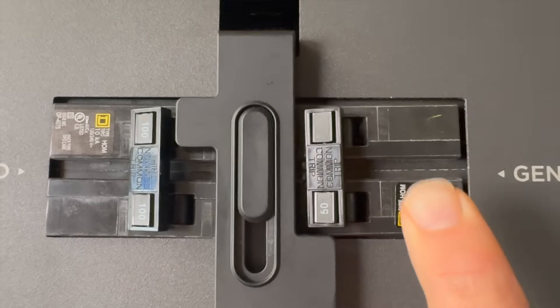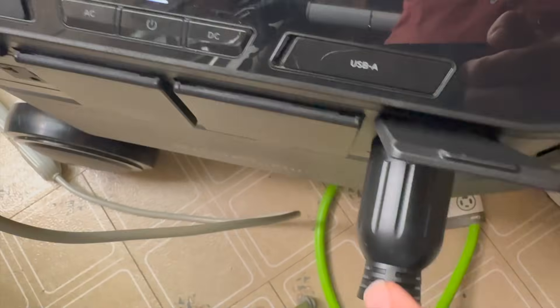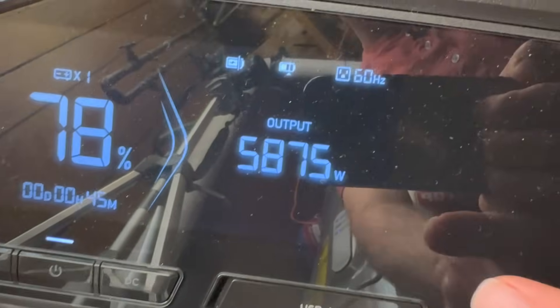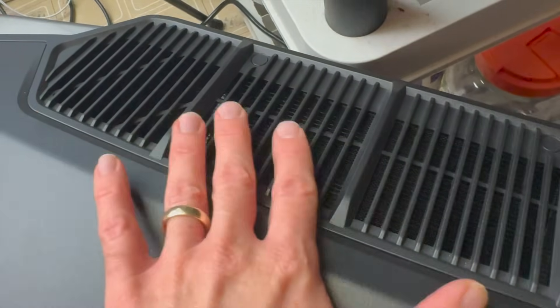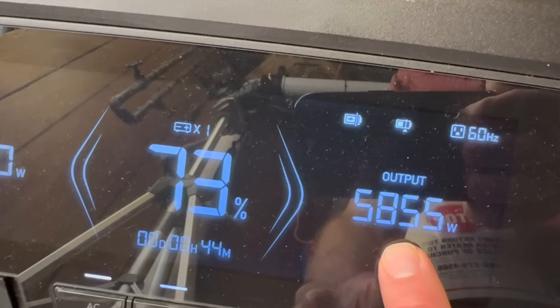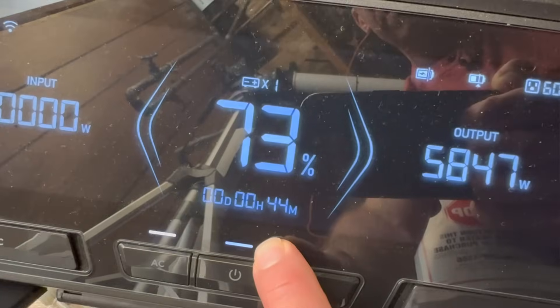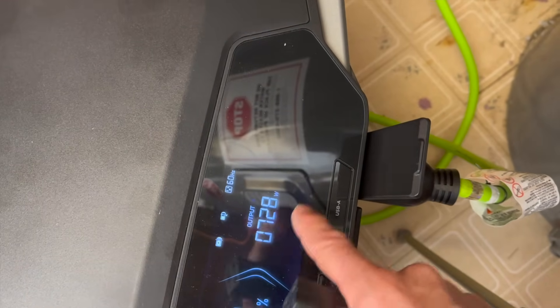The relays clicked after a couple seconds — generator is on, grid is off, and the interlock is preventing the grid from turning on. The Ultra is outputting about 6,000 watts running the house, and what's using most of that power is the hot water heater right behind me — you can see the lower element is on heating the water. One thing I find incredible is that it's outputting 6,000 watts, about 25 amps, and I don't hear any fans from where I'm standing. The estimate shows 6,000 watts of output at 73% state of charge, guessing it would last about 44 minutes. Once the hot water heater reaches temperature, it's not drawing as much current.